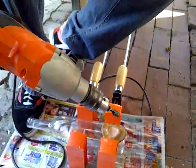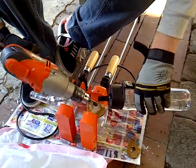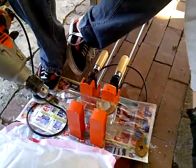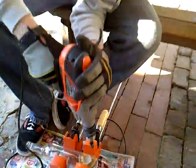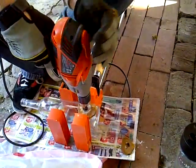We're really close to going through. This can take anywhere from a minute to maybe five minutes depending on the thickness of the bottle. I'm going to cool it down, because the last thing I want is for it to shatter after doing all this work, but we're really close to the end here.